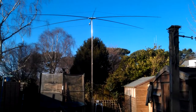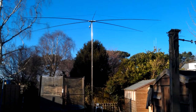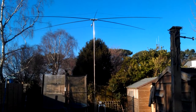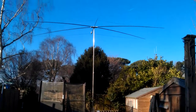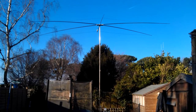Welcome back to 2E0 VOV. We're testing a 20m Moxon on the first build — still rough cut. SWR seems to be resonant at about 14.230, and it seems to land very nicely around 50 ohms.